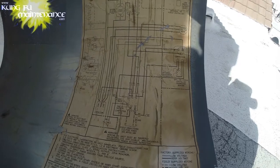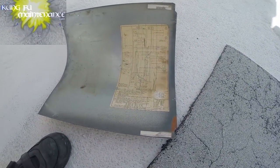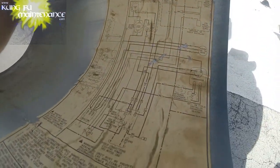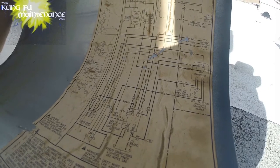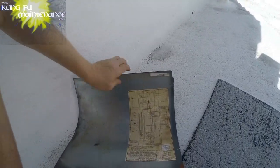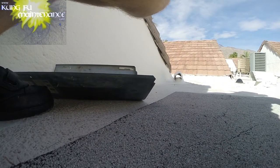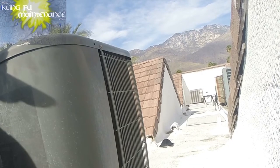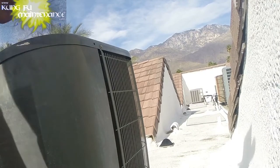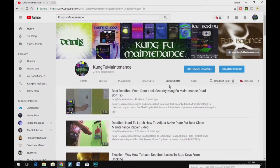It's nice if you can use either contactor — a single pole or a dual pole. There may actually be some advantages to each type of contactor, and I'll go into that in an upcoming video covering the comparison, or the pros and cons, of single pole versus dual pole contactor. But it looks like on this Amana we can go with either a single pole or a dual pole contactor. A quick search on my YouTube channel for whatever your maintenance needs are should find a bunch of different material that'll be helpful.